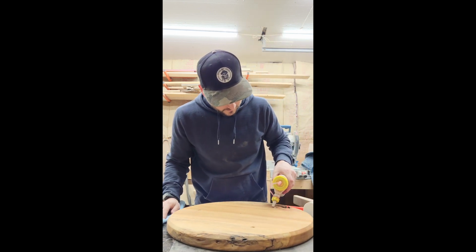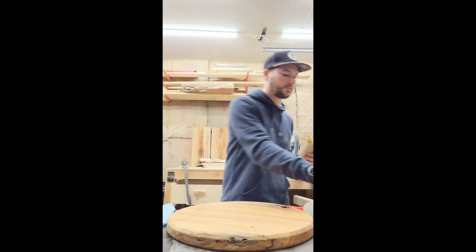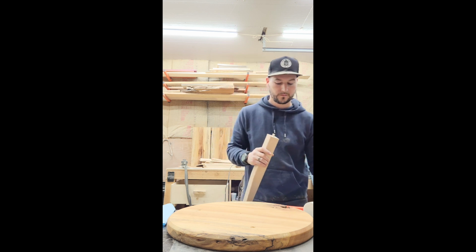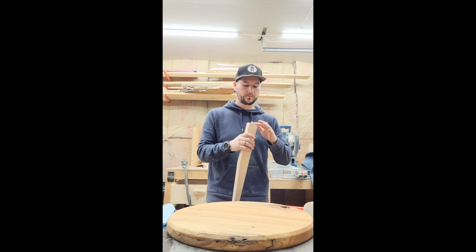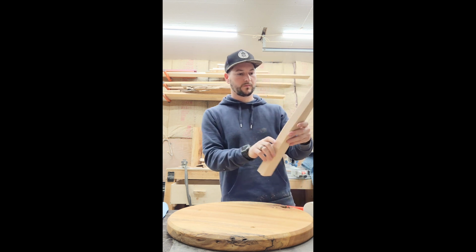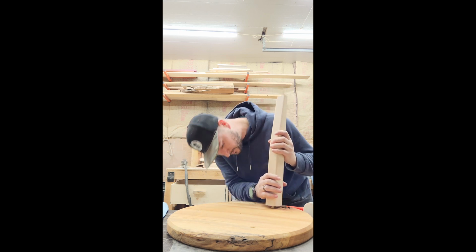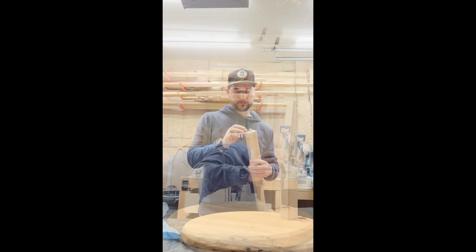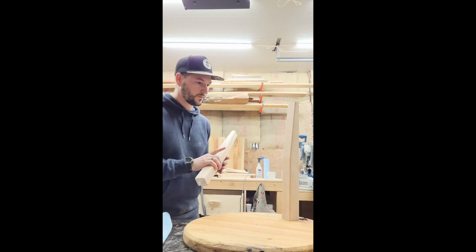Take the tabletop, get some glue in those holes. I want to make sure this is stable. My hope is that this replaces an end table that we have that we like, but is very unstable and a bit fragile, and with our girls, the fear is that it will break. So hopefully this is sturdy enough to replace that. I didn't want to risk it being wobbly or uneven. So I've got that taper facing the center, that angle, having them flare out a little bit, hammer it in, and then I lined it up to the center so that they all faced equally.